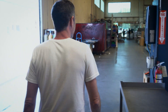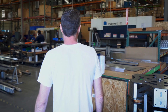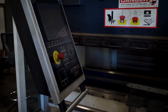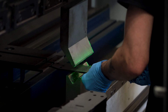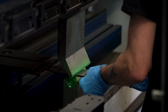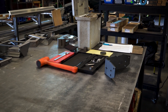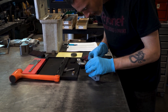Welcome everybody to the press brake center. We've got James de la Verne — today he's our press brake operator who bends all of our metal with great precision. He's been with Riley Hopkins for 15 years, so he really knows his stuff. Right now James is bending his first part and figuring out where he needs to make precision adjustments. With the protractor he's able to determine what angle adjustment he needs to make to ensure the part is 90 degrees.